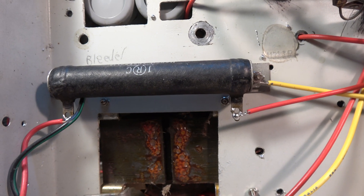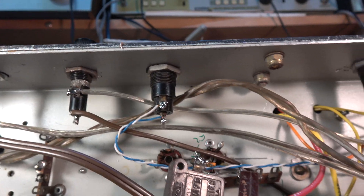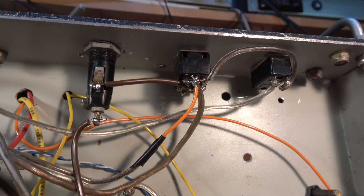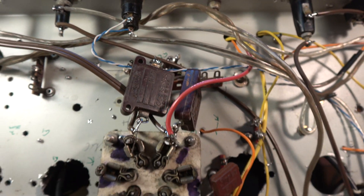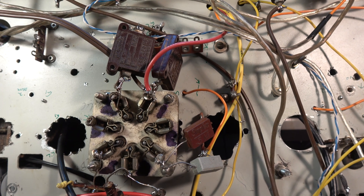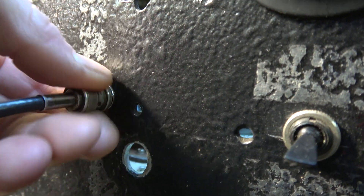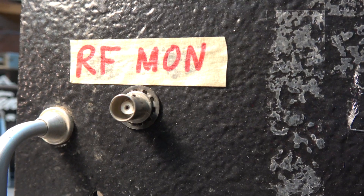Turn off the set and in about 20 seconds all the HT is dissipated. That's really all there is. Most of the other stuff is DC switching and fuses. I tend to use slow-blow fuses so you can have a fuse rated close to the actual current and it won't pop on the turn-on surge — a little more expensive but certainly worthwhile so things don't start to melt. You just feed 50 ohms in there, and I have another output there — an RF monitoring tap to feed a scope or modulation monitor.